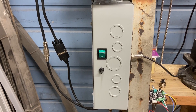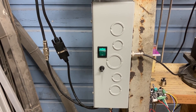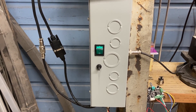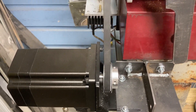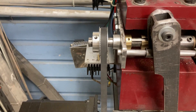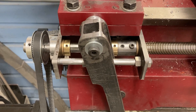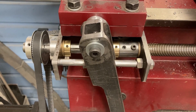I still have full access to run long stock through the spindle. The signal from the encoder comes down into this box — all of my electronics are inside this, and various wires and connections come out of it to run the rest of the system. Here we have the stepper motor, also using timing pulleys and belts, going up and driving the lead screw.